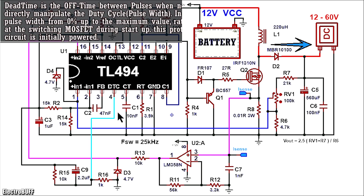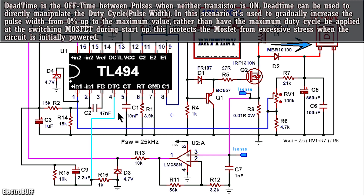The dead time control pin 4 can be used to set the duty cycle. I'll be using this for soft start purposes. Soft start ensures that when the circuit is powered, the switching MOSFET is not exposed to a large surge current. The output PWM will increase gradually from 0% up to a set value so the MOSFET adjusts gradually. For soft start, you'll need a circuit made up of resistor R15, capacitor C9, and resistor R16 connected as shown.